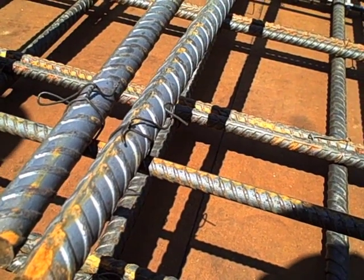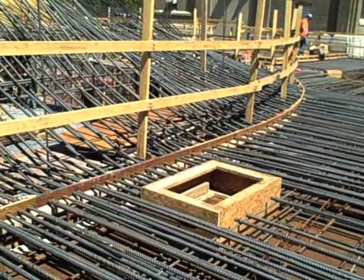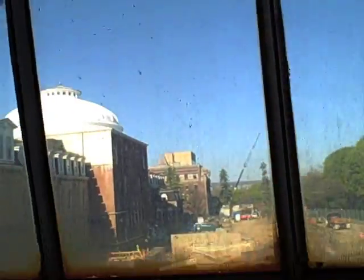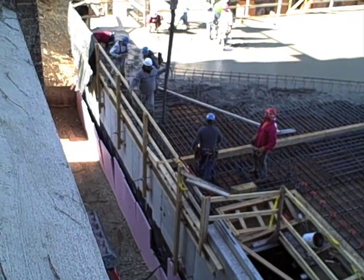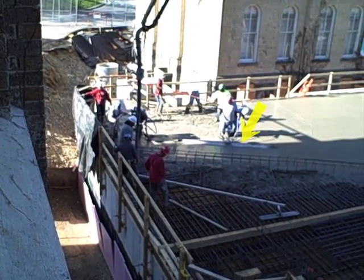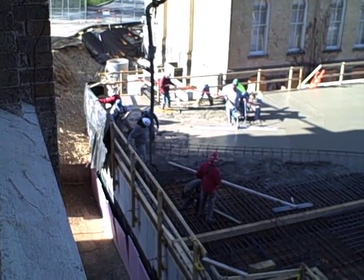This cover provides protection against both corrosion and fire. And these cutouts — any idea what they're doing? They're all mechanical cutouts for ductwork to come through. And along that diagonal, is that also mechanical cutouts? Once all the reinforcement is in place, concrete is pumped into the form. The concrete is then finished using various specialized tools, including a power screed. The main idea is that when they finally finish, they have to be at a point where they can actually get down without walking over the fresh concrete.